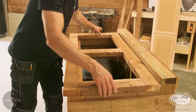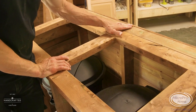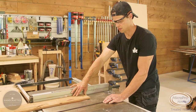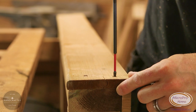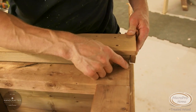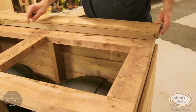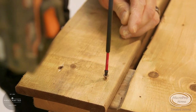We've made the lid frame — it's time to put our fence boards on. We're going to put them all the way across and even put a fence board right up at the back so that when we attach the hinge they're at the same height. I'm fastening in the top cap for the back of the frame. I've left an overhang to allow for the fence board that finishes off the top edge of the skirt. I'll cut four more boards at 49 and three-eighths inches, set everything in place, make sure they're all in line, and screw them down.